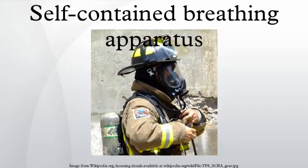For firefighting, the design emphasis is on heat and flame resistance above cost. SCBA designed for firefighting tend to be expensive because of the exotic materials used to provide flame resistance and to reduce the weight penalty on the firefighter. Modern firefighting SCBAs incorporate a PASS device or an ADSU into their design. These units emit distinctive high-pitched alarms to help locate firefighters in distress by automatically activating if movement is not sensed for a certain length of time, also allowing for manual activation. The layout of the breathing set should not interfere with the ability to carry a rescued person over the firefighter's shoulders.